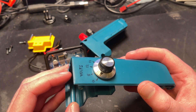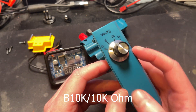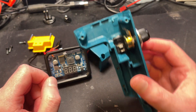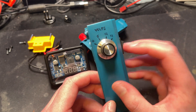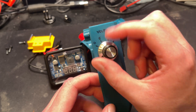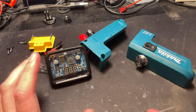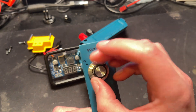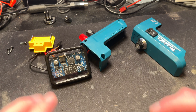This is the matching potentiometer I got from Amazon. I can't remember the exact specs — I'll put them up on the screen — but it matched the trim pot on there, and this allows me to connect the three wires here into the three wires on the pot, and that gives me control. Now initially this was backwards, but in the process of taking this video I have fixed it, so now it's the correct way around. This is the lowest stop of the potentiometer, but it actually goes around a lot further than required. These buck converters can only go up to the supply voltage — they can go up to 36 volts — which is why that approximately covers that whole range. You can leave the trim pot, it's fine, but I decided not to.